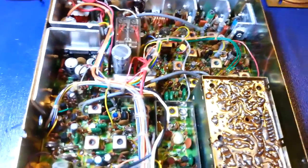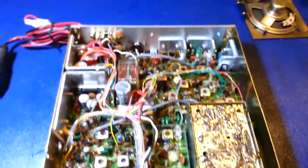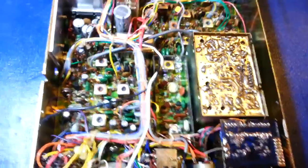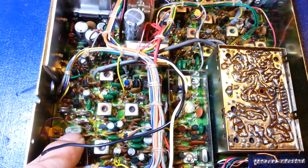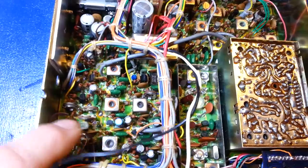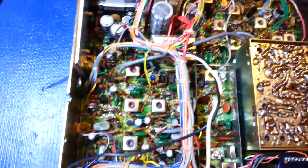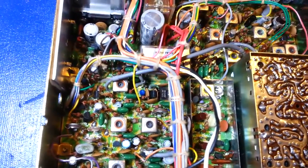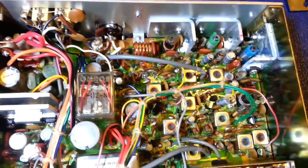So, add green poly drop capacitors to the list alongside old carbon composition resistors, aluminum electrolytics, and tantalum capacitors going bad. This is a heads-up for people who work on 70s and 80s vintage electronics — something to keep your eye out for. I'll be changing all of these because they're no longer environmentally sealed. As soon as that epoxy gets the slightest crack, it's open to the outside environment and the aluminum foil inside will be prone to oxidize as moisture gets in.